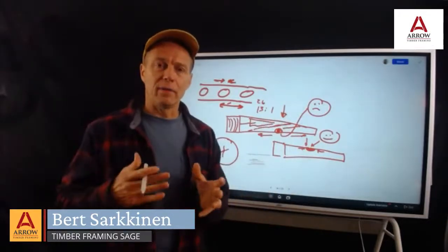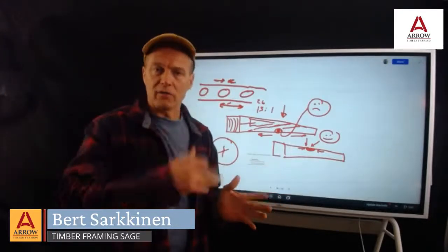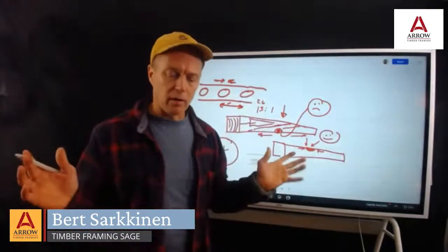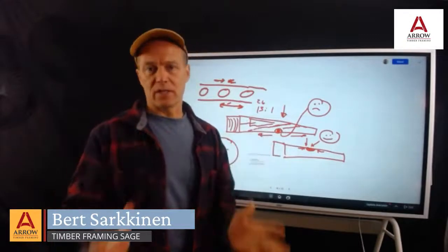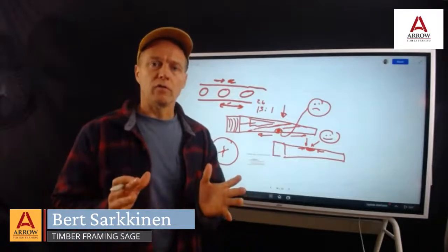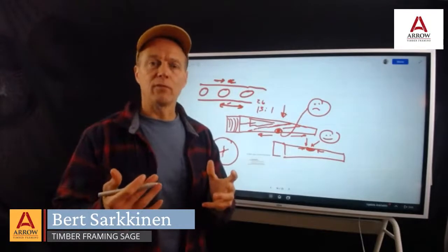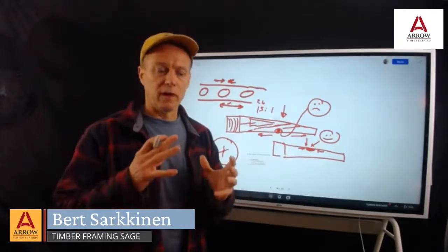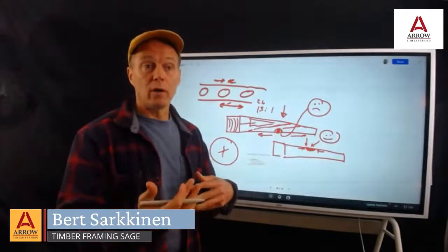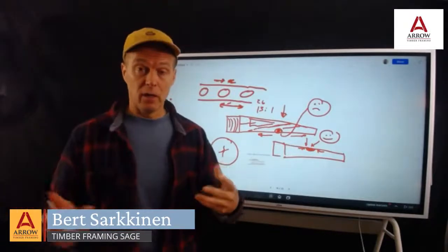So the way that happens is 100 pieces of wood, say, are gathered up and they're all tested for loading. Where do they fail? The 10 foot span, and it's all marked out. And then the weakest 5% are used for calculations. So there's a pretty big safety buffer there. And then on top of that, whatever they come up with for their minimum, engineers have a times five safety buffer for what is allowable. And that's for any type of buildings that humans are going to occupy.